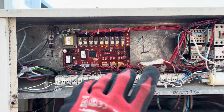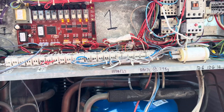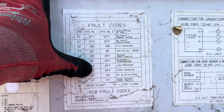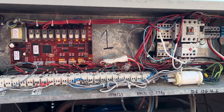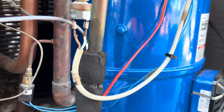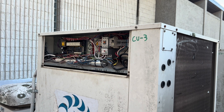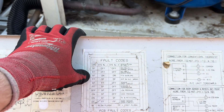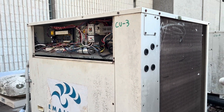We'll have a look at what this fault is — they're flashing differently. This one: CPU on, system one slow flash — high pressure. And the other one: CPU slow flash, system one fast flash — sensor open circuit. All right, we'll start with this one.